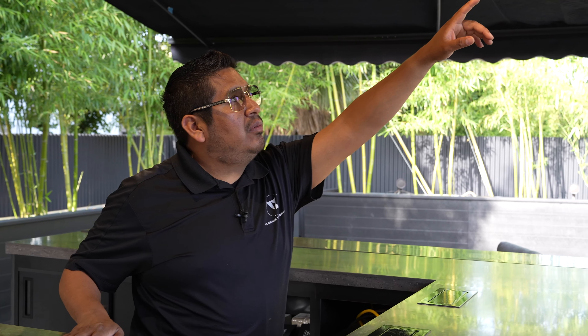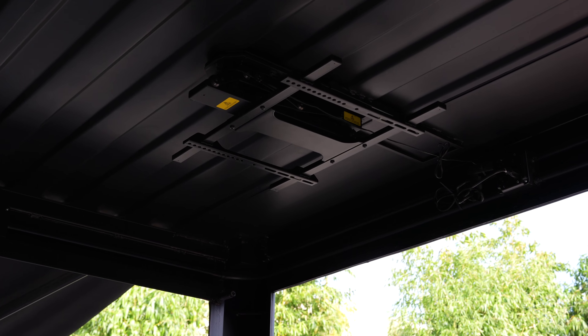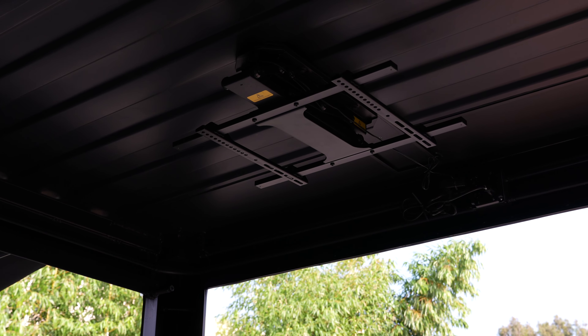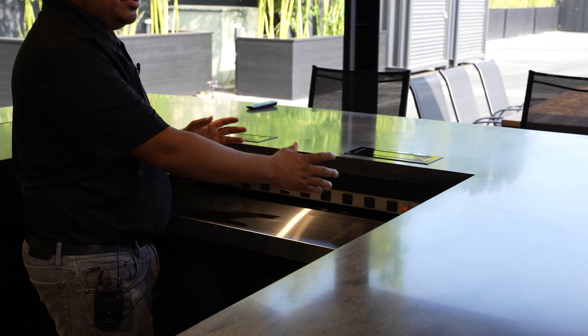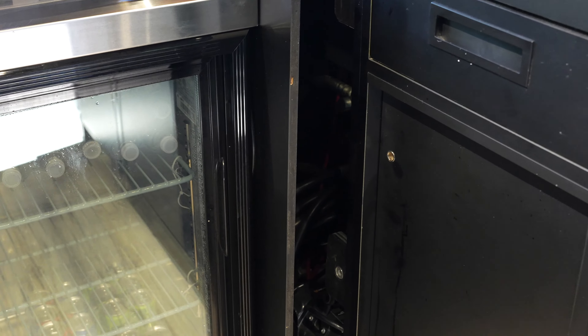Here's the ceiling. You can see the exposed electrical — that's really the only way that looks better. We incorporated a fan here that acts to cool the container down, so that in cold weather it doesn't create condensation. It's automatic: as soon as the temperature inside the container reaches 100 degrees, it turns on and opens at the top, releasing hot air to cool the interior so materials don't expand and shift. In case of rain, if the vent is open, it detects the water and closes by itself.